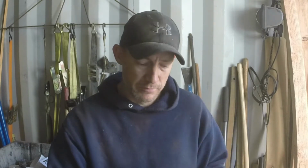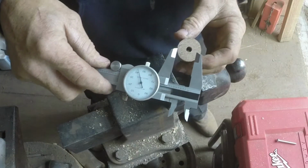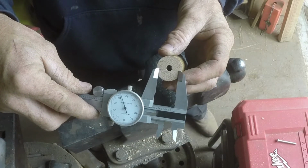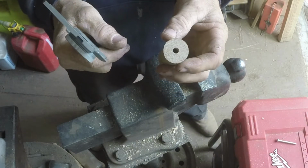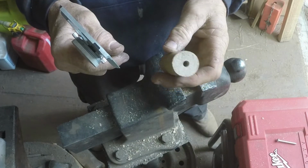Next thing we need to do, we need to get this the same diameter so it looks like it goes there. So go down to the wood burning stove with our micrometer and measure that and mark it out on the top of this piece of wood. Start shaving it down. So this is the measurement off the wood burning stove. It doesn't look like we have a whole lot of material to take off here, and we could get away with taking off a little bit less and then putting a bevel on this edge where it matches up. So we'll give us a nice sturdy handle to hang on to. Won't have a tendency to crack out.